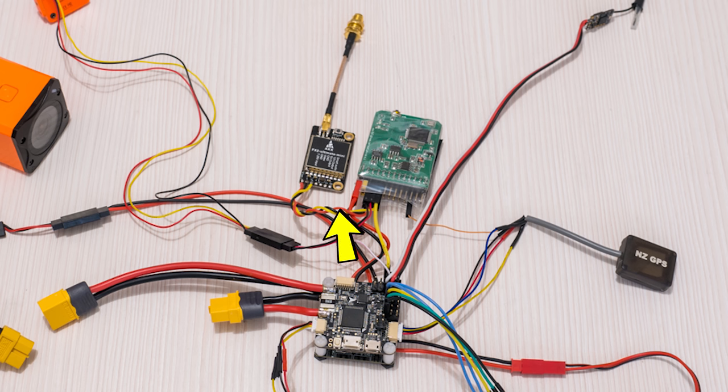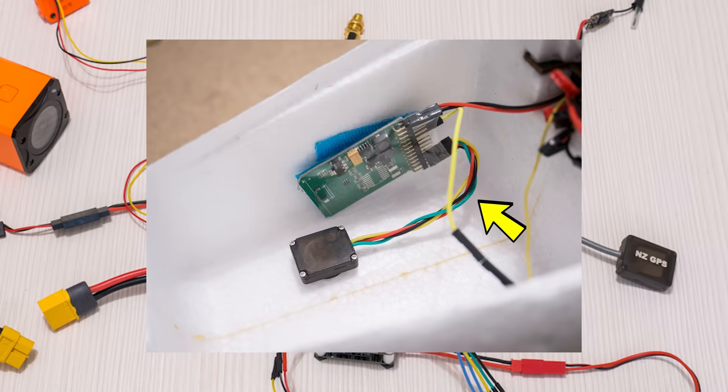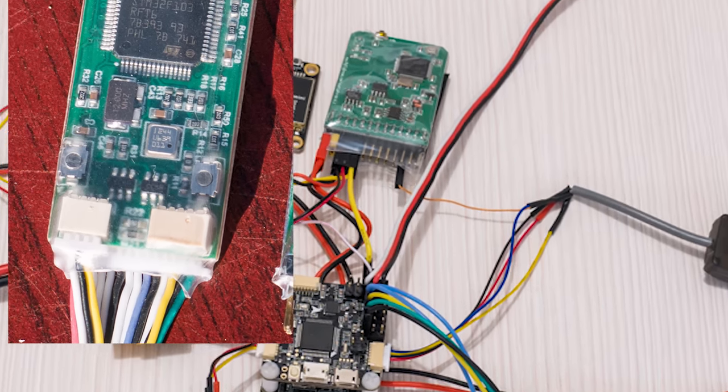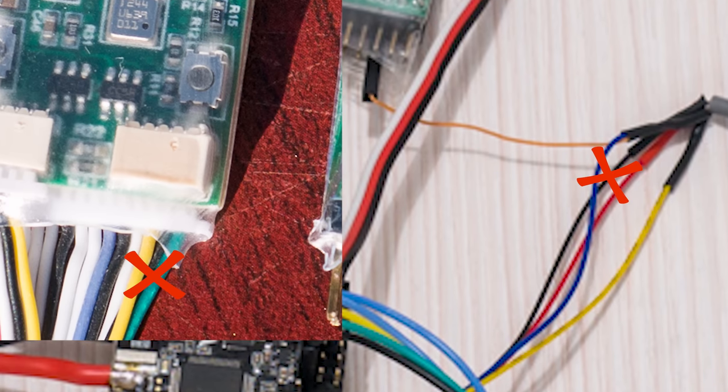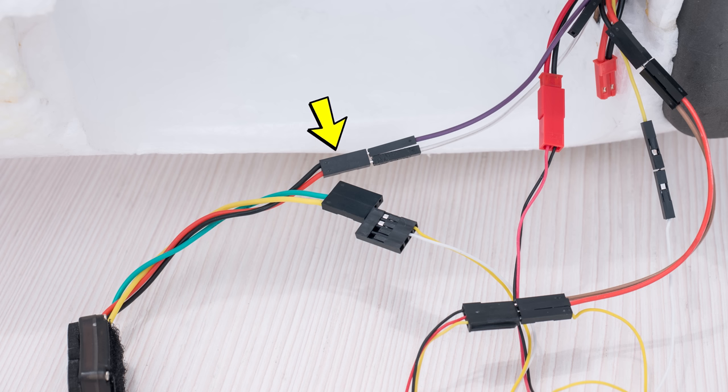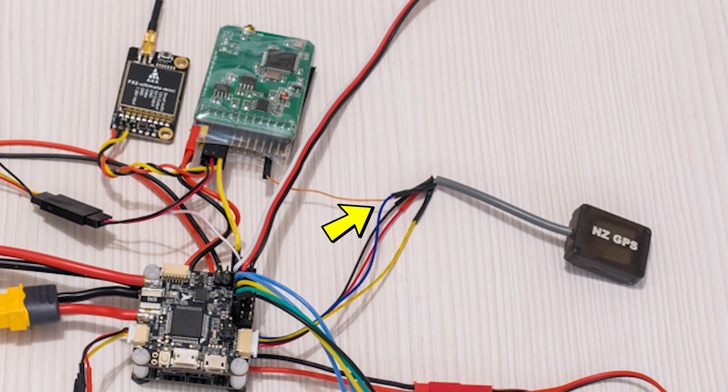Video goes in, then video goes out, and you do need to provide power — 7 to 12 volts would be fine. In order for it to get GPS coordinates to encode in the video, it either needs to have its own dedicated GPS unit or to listen in on the one the autopilot is using, in which case you need to split the TX wire coming from that GPS and plug it into the GPSRX port on the Telefly Tiny. Assuming you are powering everything from a single battery, you should not need to connect the ground from the GPS unit. TX from it goes to RX on the OSD, and if powering with 7 to 9 volts you could power the GPS from the OSD, but 12 volts does make it heat up quite a lot. So I just have a separate SBEC providing 5 volts for the GPS unit, though my preferred method is to split the TX wire from the autopilot's GPS unit.